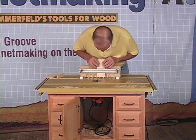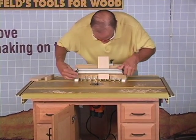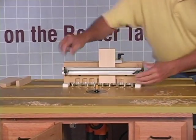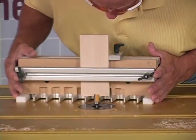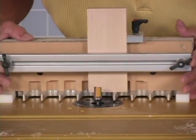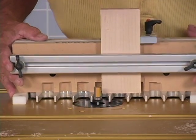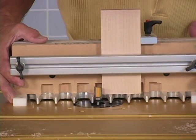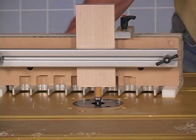on the other side of the jig now. Okay, we don't move the position of this stop. That comes over, sets, and again, we clamp. All right, now, when we do this, there's a bearing on here too. I always start on the left side over here, and I'm going to come into here on the bearing even and cut into here, come down this one, come here. And here, I don't want to come here first. I want to come out here and clean the outside so I don't get any chipping. So if you got something that's in an open space like this, come to the outside first and clear that out, and then come on the inside. You'll watch how we do it here.